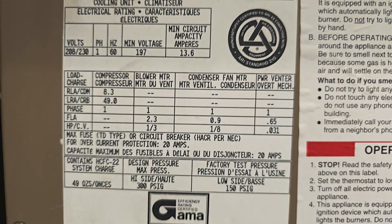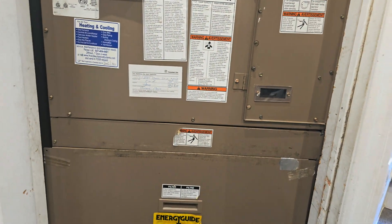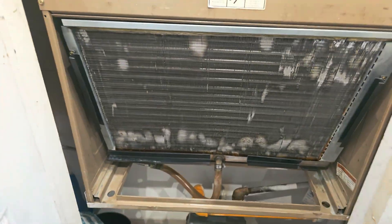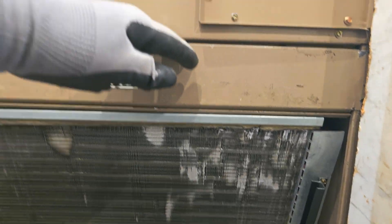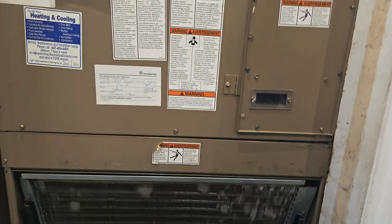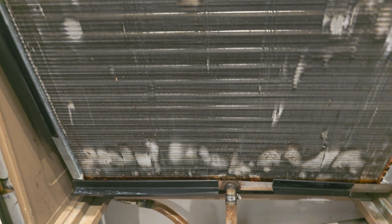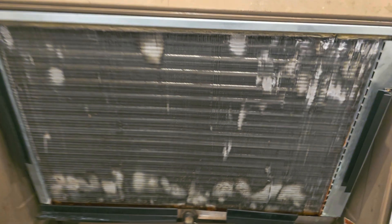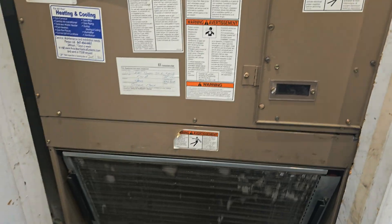Let's take a look and dive in, and I'll let you know what's going on here. So I took off the air filter - here down is my AC and here down is my heating system. On my line here I can see about less than half, which is where I have my cooling. It's a sign I'm already kind of low on refrigerant, but I'm going to put on my gauge to see what's happening here.